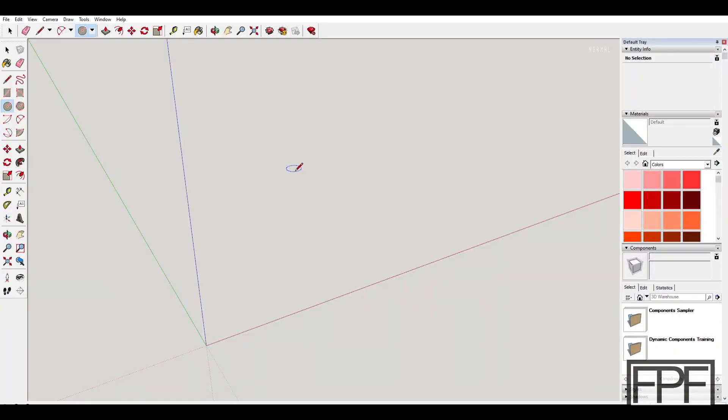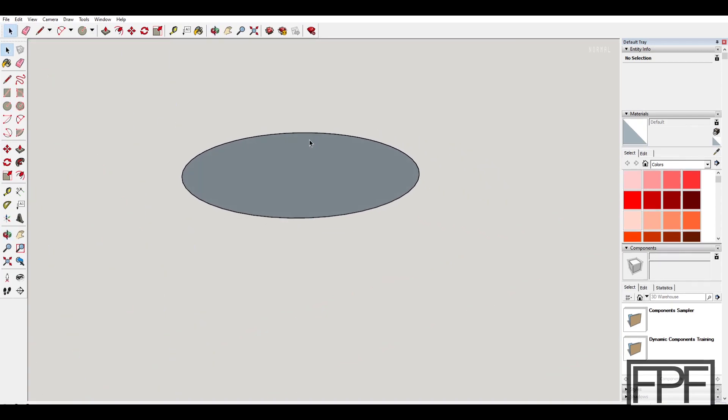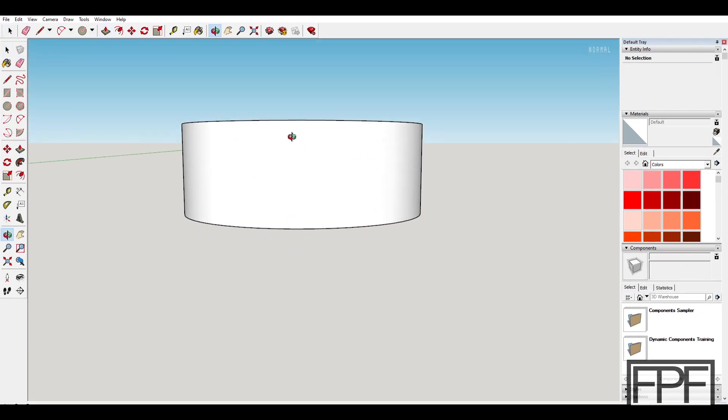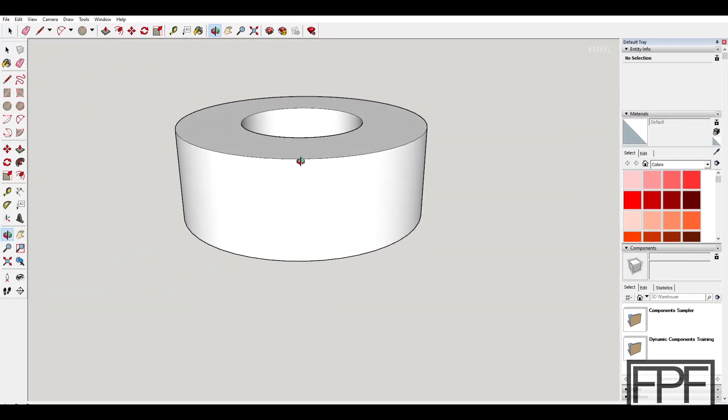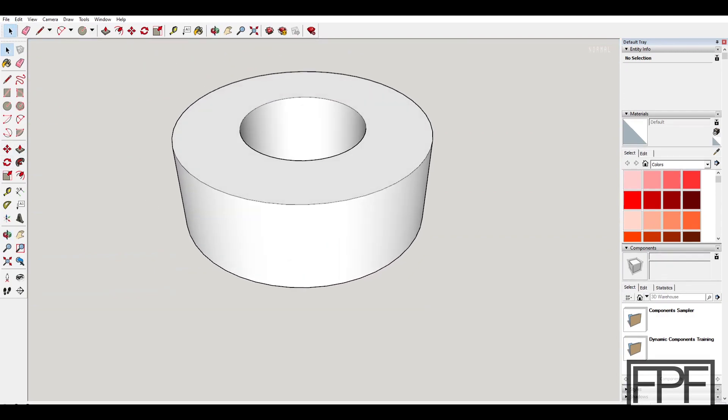Let's start with the overall diameter and work inward from there. We measured 20mm depth and we want to come up from the top of the table by an additional seven millimeters, so we want 27mm of total depth. For the first 20mm we only want the diameter of the inside of the hole, which was 54mm — so we draw another circle, with a radius of 27mm.